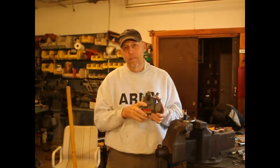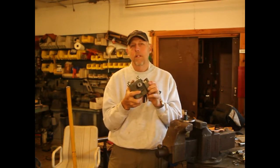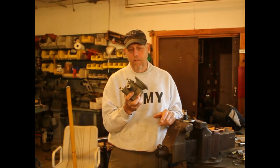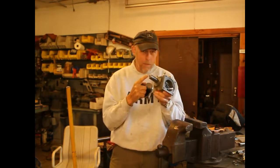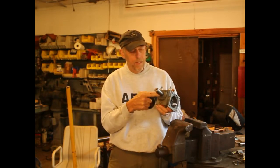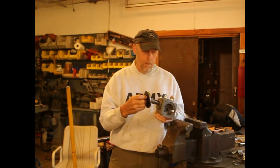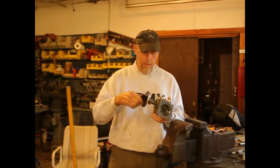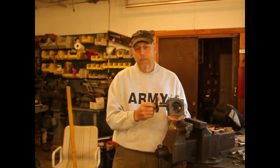I have in my list of assets out of my junk pile a fairly new Boston 100-to-1 right-angle gear drive. This is what I'm going to use to run the catclaw cam with. I've made an adapter — the adapter's a little long, but until I get it set up I don't know where I want to cut it. I've made an adapter that fits the shaft out of the right-angle drive, and I threaded it to fit this — I think it's 3/8ths fine thread. That just screws on here, just like in the catclaw videos, and this will turn.